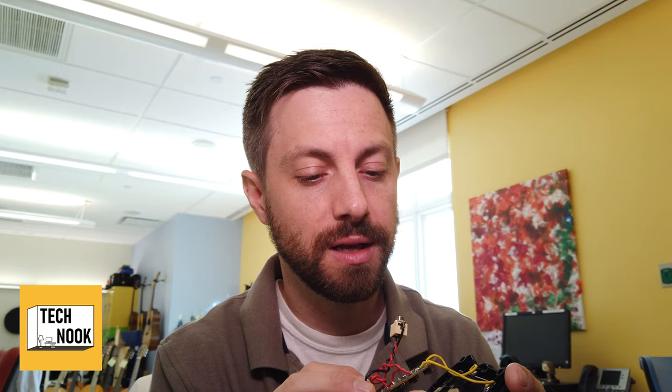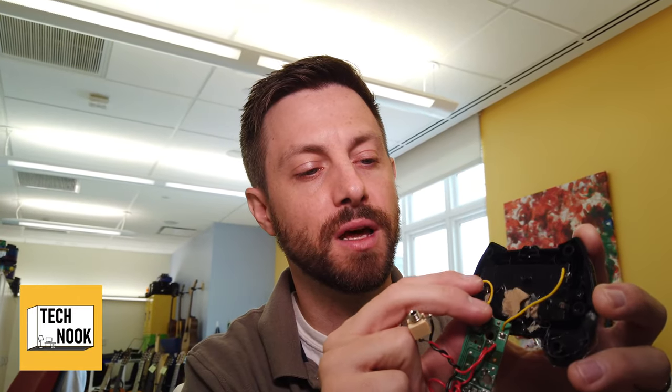Feel free to ask questions about this, like email us and we will do our best to walk you through it. YouTube is also a good resource. I think if you just look up toy hacking, we'll get some great resources. You want to be careful when you do these because sometimes the solder joints to other components are really fragile. And if your solder is too hot, you might melt it. So make sure you don't melt your components because that's another way to break your toy. But sometimes they're easy, you can fix it. Like this one, the joint came off of the battery pack, so you could just solder it back onto the battery.